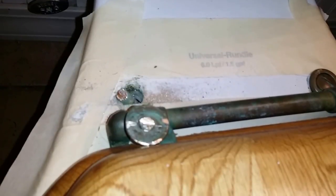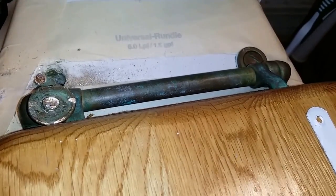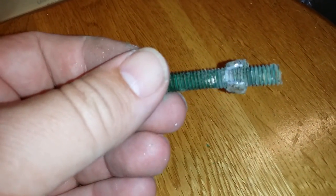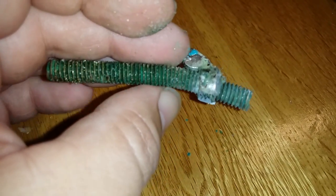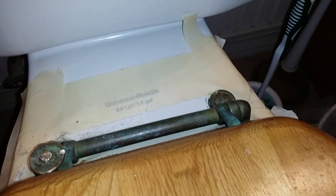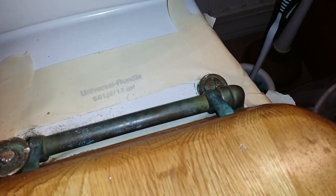This is a lot less messy, and in the case of the second bolt I can't even get the hacksaw or the reciprocating saw in place. Alternatively, I noticed the wing nut is so corroded underneath that when one side came off it took the wing nut in two. So all it would take is a little bit of a chisel or something else to finish breaking the wing nut off, knock that out, and just pull the bolt out. This other side is a little tighter and I can't even get my hacksaw underneath it, so if it's stuck and too tight, you'd have to go back to the drill and just drill that screw out from the top — it's so weak you can just tap it out.